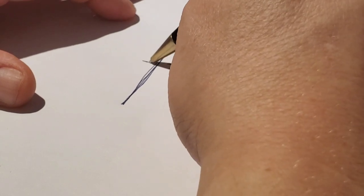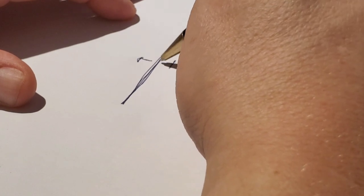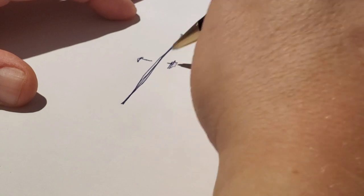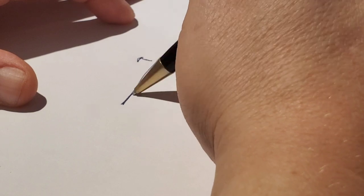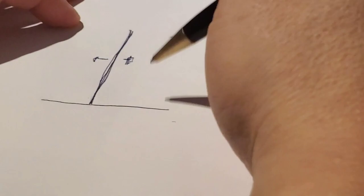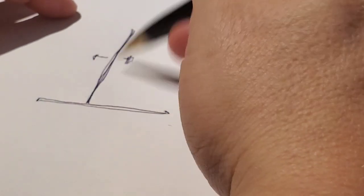A carriage bolt, actually, that's going to have a carriage head, and it's going to go through that front, the wood style, and then pop out the back, and then you're going to have a nut and a washer, and you're going to tighten that together to this vertical strut. That vertical strut terminates in a horizontal strut that is the skid, I call it, on the bottom. And this is the basic premise of the thing.